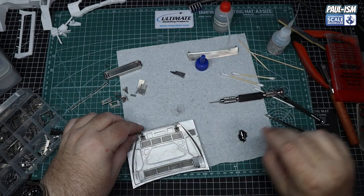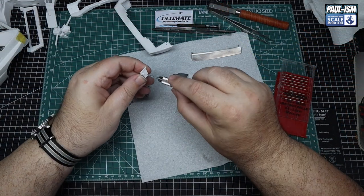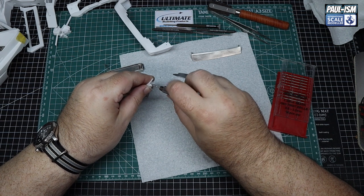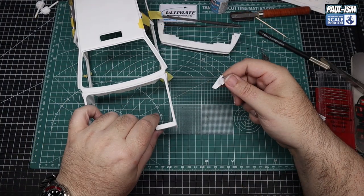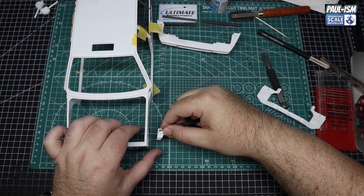And then our 1.4 by 3mm screw is screwed in place. And then there's a 1mm pin to go through the side. Same with these bumper supports on the side. If the drill bit is going into a part like this, we'll do a 1mm hole. And if it's just passing through as a separate part like this outer piece, it's a 1.5mm.